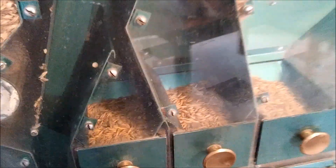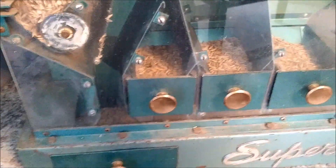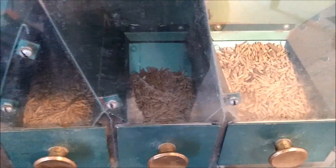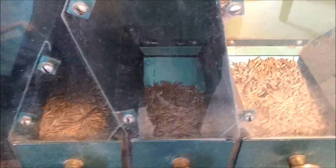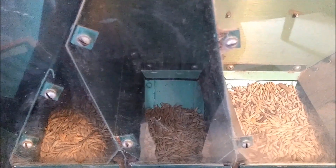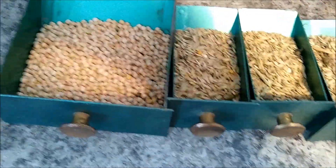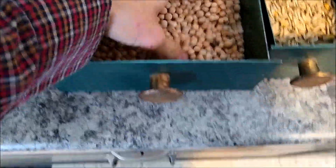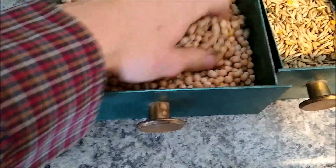I went ahead and stopped there. I'll now show you the different fractions. One thing I would like to say: with the larger fractionating aspirator, shutting down to clean the fractions out would not be necessary, because it is equipped with belch gates — as they fill up, they drop out on their own automatically. Here are the different fractions. This is the heaviest fraction — what fell out the bottom — and you can see it's mostly just the peas, which is what we want.